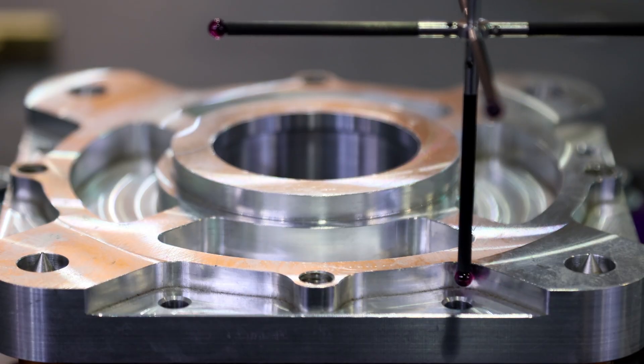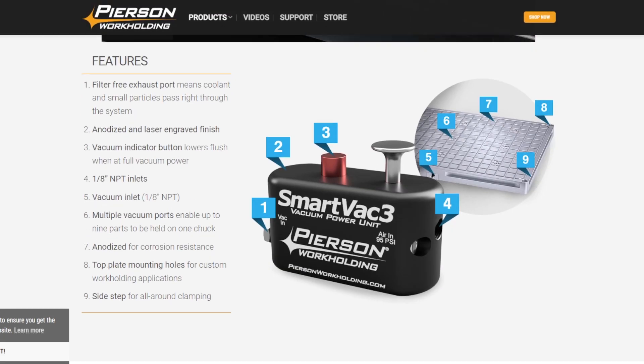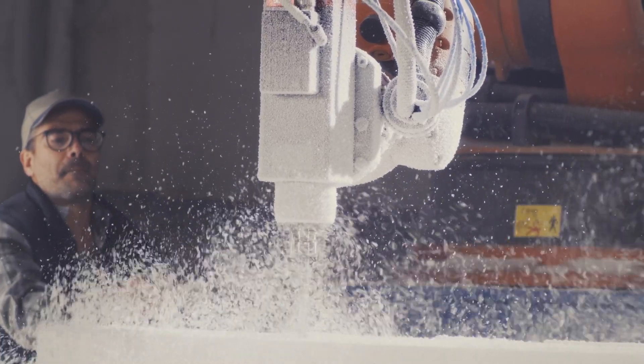In addition to power, consider the air requirements for your inspection equipment. Most CNC or DCC coordinate measuring machines require compressed air to operate — the air bearings allow smooth and efficient movement of the machine's axes. Another reason for compressed air is fixturing: non-rigid parts often require a vacuum fixture to suck parts flat during inspection, and an air supply allows the use of a Venturi pump when a vacuum pump isn't available. An air supply is also very useful for spraying dust off parts prior to inspection.